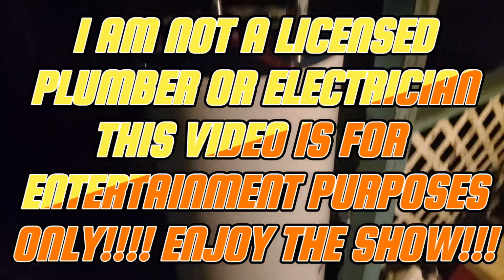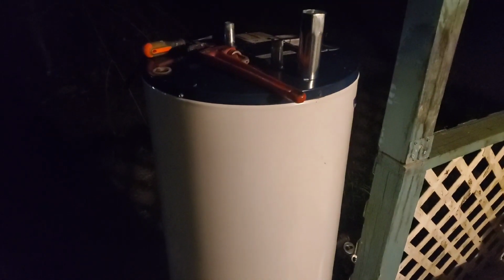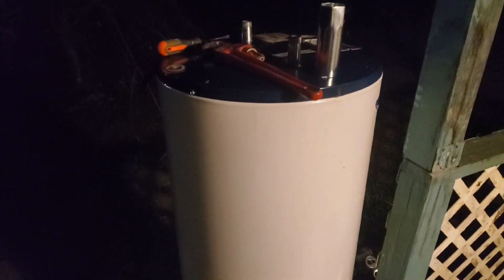Why is my 40-gallon hot water tank outside, you ask? No, we're not replacing it. We're taking care of it so we don't have to replace it. It's been here for many, many years, about 6 or 7 years, and that's the average lifespan of these, 6.4 years. But I did some testing with my voltage meter and determined I had one heating element out.